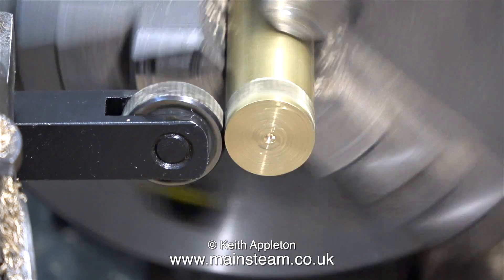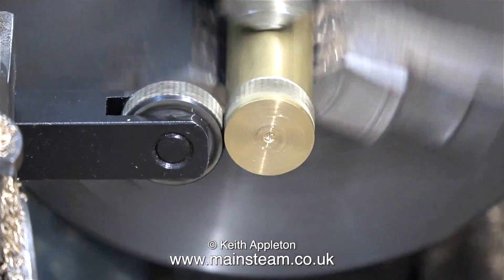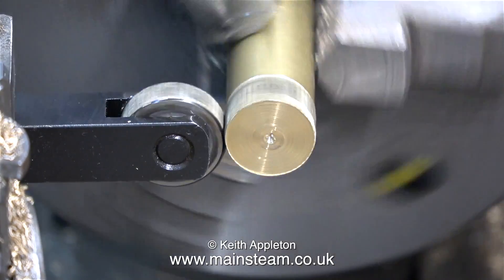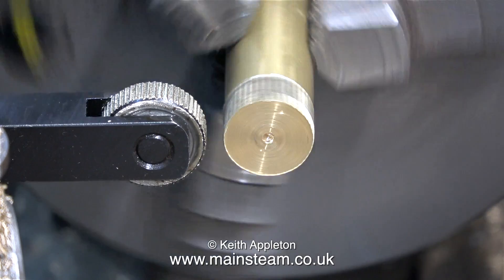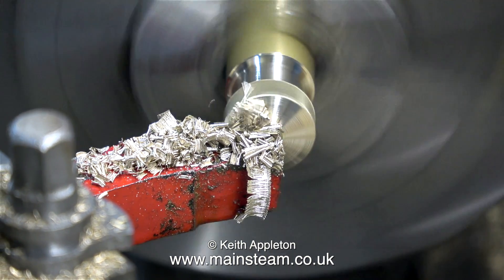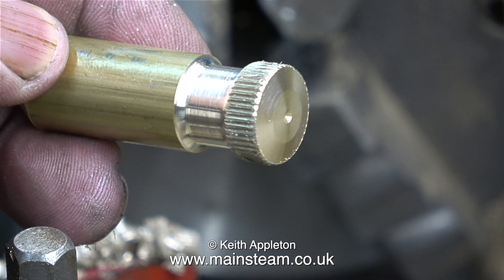I think it's going to be more suitable for brass, so I'll try it on a piece of brass. I did find that by applying pressure with this single-point knurling tool it actually rotated my top slide, mainly because it wasn't very tight. So I tightened it up at both sides with the set screws, and now the knurl is much more square to the work. I managed to produce quite a deep knurl — maybe a bit too deep — very quickly. The knurl doesn't look too bad; the edge is quite dangerous, so once again I used the cutting tool to clean up the edge. I also turned some of the metal down behind it too. Initially the knurl didn't look very good, but once I cleaned either side of it, it looks all right.